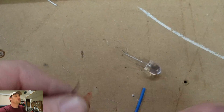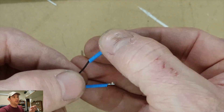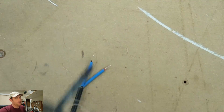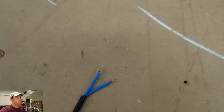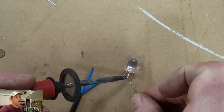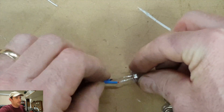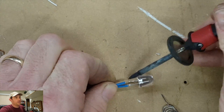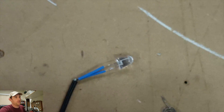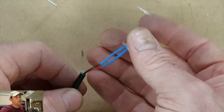I'm cutting up some blue insulation — that's like heat shrink basically. I slide it over the top of the wire so that when I'm done soldering it to the LED, I can cover the leads so it won't short out to the inside of the metal pipe, because that entire lamp is all copper. Another important note: on LEDs, the positive leg is longer when you get them out of the bag. When I trim them down, I always leave the positive leg a little long just to remind me. And if you know anything about LEDs, I made a mistake here — I missed installing the resistor. You've got to do a little bit of math with LEDs. In this instance I should have put about a 100 ohm resistor in there and I forgot, so I ended up having to replace that.